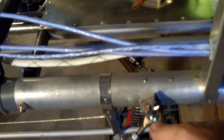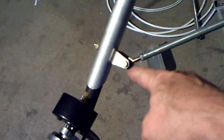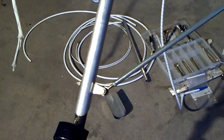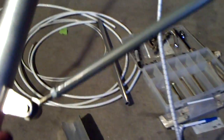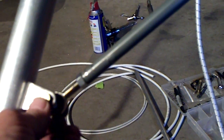The main landing gear is connected. I drilled and bolted up the forward landing gear struts, which are hinged at the landing gear and at the fuselage via this ball rod end.